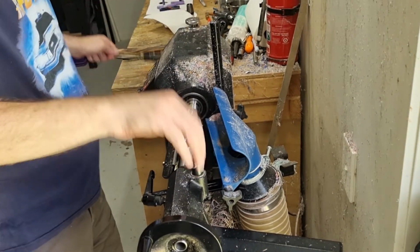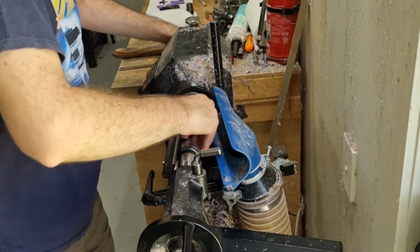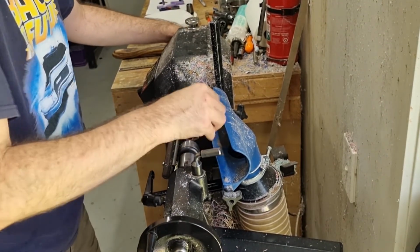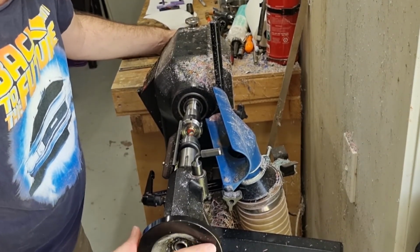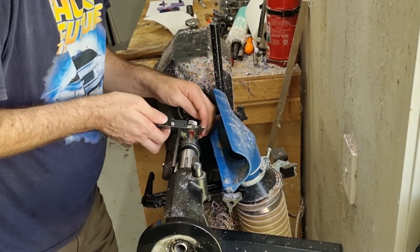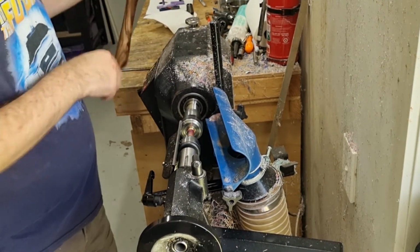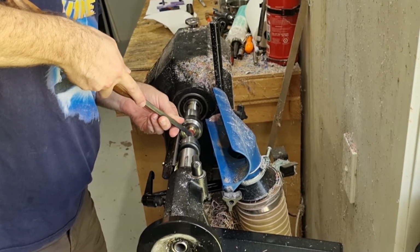Do much more of this until I unscrew it. So I'll loosen the tailstock, unscrew it a little bit so there's a bit of a gap there, and then I'll retighten. We'll change the concentricity a little bit, but by turning again now we'll fix it all up. So we're about 15 here or something, so we need to go down to about 12. So that's where we need to be a bit more careful. It's got a little bit less support.